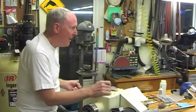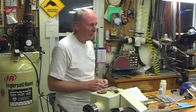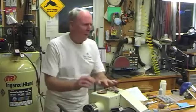Right. I've never used one, but I've seen them used, and it makes sense. As soon as the dot disappears, you're at your wall thickness. It's handy for deeper things, like if you're making a deep vase or something like that. But if it's narrow and shallow like this, I may as well use an Easy Wood tool. Well, if you do a few of them and you're using similar woods, you can hear. Exactly. You can actually hear the wall thickness. Yeah, as you're getting out there.